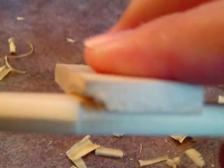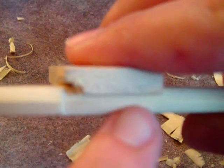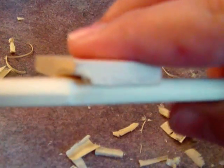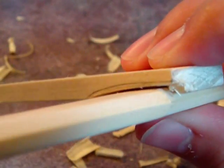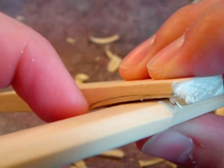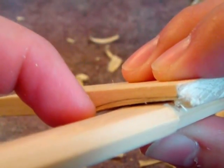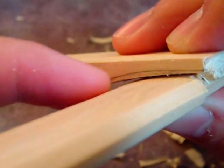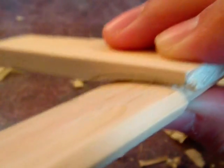You can see, because it hasn't quite sunk all the way down, it needs to be deeper, because you're aiming for it to line up with the end of the top of the spine that you've carved. That's not deep enough, so I know that much. I can also begin to see that the bevel's starting to take on the shape that I want, because it's got an even spacing all the way along the side of the blade. But there's a big gap over here, so this has to be recessed and then curved over more.